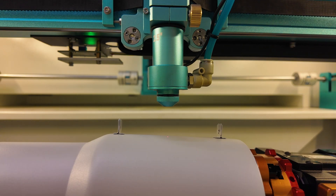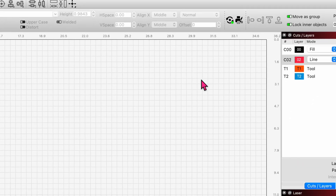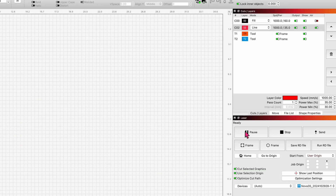Now I've got a whole lot of clearance and I clear the mounts very easily. Back in LightBurn, I'm going to right-click Devices because I was using LightBurn before I turned the laser on, so it hasn't been looking for it. Right-clicking Devices forces LightBurn to go back out and see if it can see the laser — and it did. I'm on the Nova Plus, my design is already pre-done, Origin is at the top. In the rotary window, the green dot tells me it sees the rotary and it's connected. I have it on Chuck — that's what my Grip 2 does. Steps per rotation is 30,000. My diameter is already inputted at 3.895 inches, and it's giving me the circumference. Settings have been read successfully.